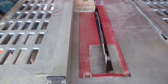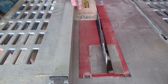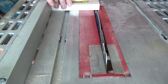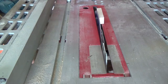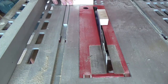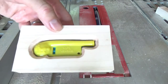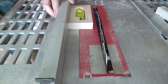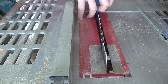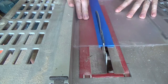I took the piece to the table saw for final dimensioning and to cut out the plexiglass front. Using painter's tape on the plexiglass helps prevent blowout and cracking when you cut it with a table saw.